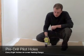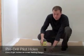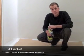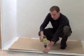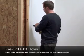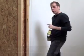At this point, you're ready to pre-drill your pilot hole. This unit has a lower nailing flange, which is meant to hold the threshold down, so you'll want to start in the center and move your way out every eight inches. On units that don't have a lower nailing flange, we supply an angle bracket — place that in the center and pre-drill through it. Regardless of your lower flange configuration, your next move is to pre-drill the vertical nailing flange every eight inches on center. For your horizontal nailing flanges, you'll want to drill at every stud.